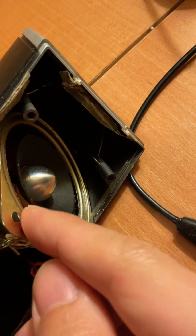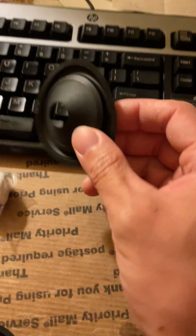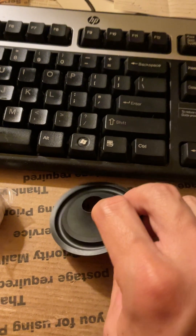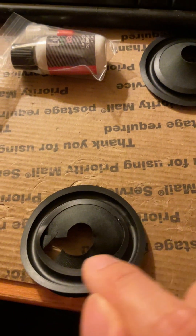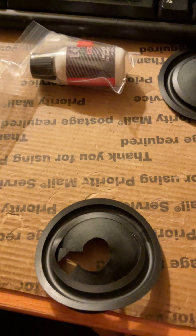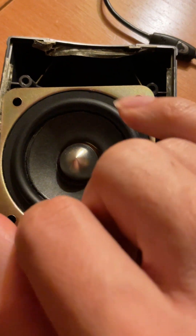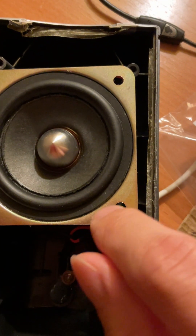Taking a look at the speaker, we see that we only need the rubber gasket — we still have the paper cone inside. I had purchased these gaskets with a paper cone already installed, not by choice, but because this gasket was exactly the right dimensions. The millimeter dimensions all match, but now I have to take off this paper cone — I'm halfway through removing it here, and it's not too difficult. Here's the test fit, which looks pretty much on par with what I expected. The paper cone on the inside is right up against the inner edge of the raised portion, and the outside lip of the rubber gasket fits the speaker perfectly.